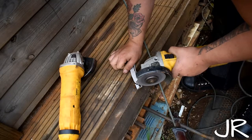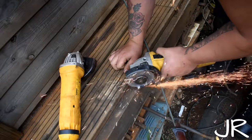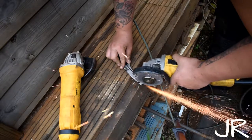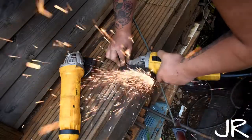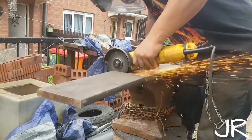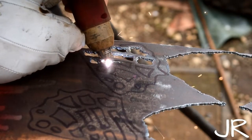Let's start with cutting. There are two in this list that I find critical. A band saw and a chop saw are nice and useful, but my main two picks are my trusty old angle grinder with a cutting wheel and my plasma cutter. An angle grinder will allow you to cut almost any size material — granted you have a big enough wheel. It might not be the quickest or the cleanest, but it does have its purpose. In my shop it's used to cut pretty much anything up to 30 millimeter. There are endless possibilities with an angle grinder, and I'm sure many metal workers wouldn't be without one.